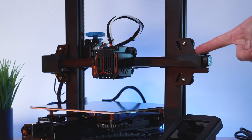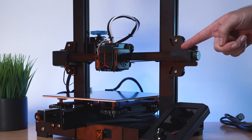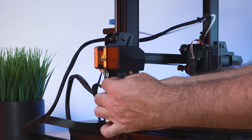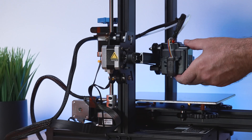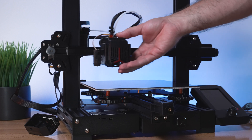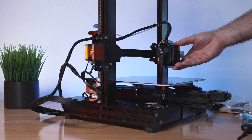Unfortunately I can't see if the belt is running true on the pulley because it's completely covered on both sides, which isn't great. If you wanted to adjust it you can't even see it - I wish they'd made a little cutout. However, on one side there are a couple of bolts that remove the cover. Taking it off, the belt is running really true right in the middle of the sprocket. Be careful when tightening with the knobs as you can't really feel the tension - pull on the belt to check.